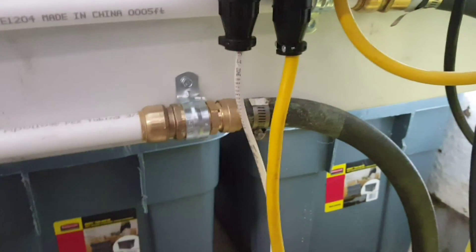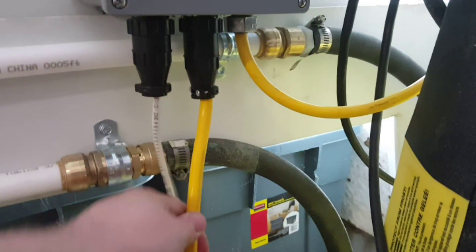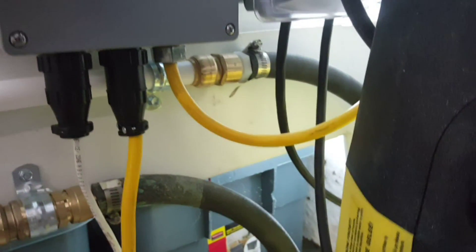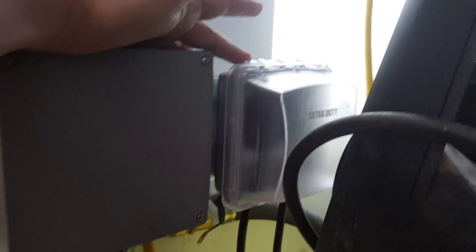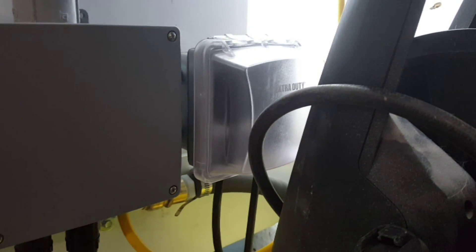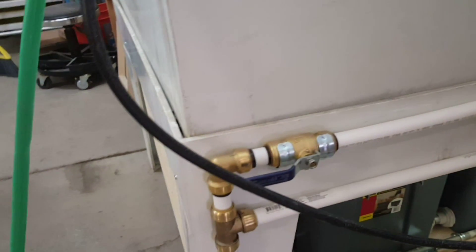The control box comes down into a junction box, and there's a control wire that goes down to the pump assembly and a power wire that powers the sump pump itself. The switches control two electrical outlets: one outlet the pressure washer plugs into, and the other outlet the backlight plugs into. It's pretty simple as far as design goes and it's been working well.